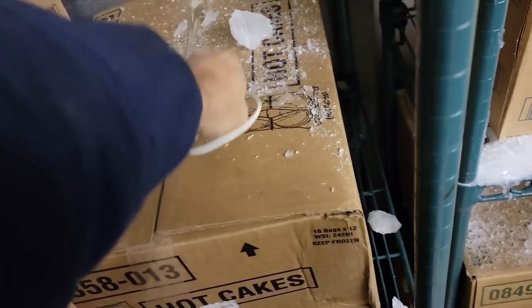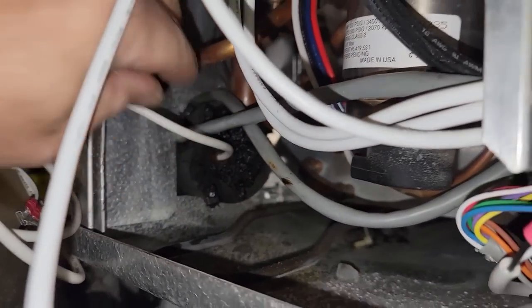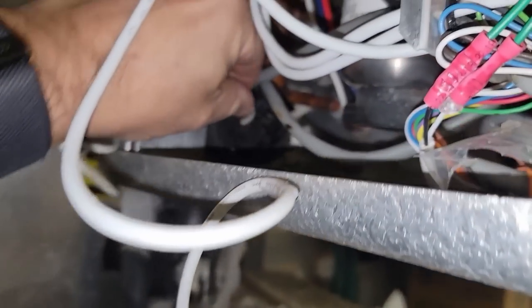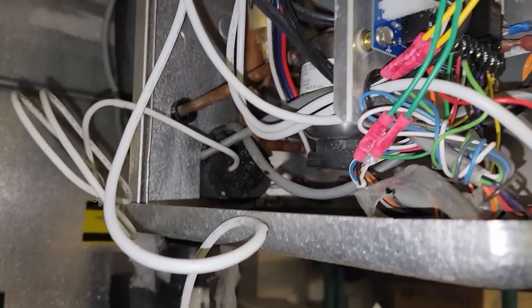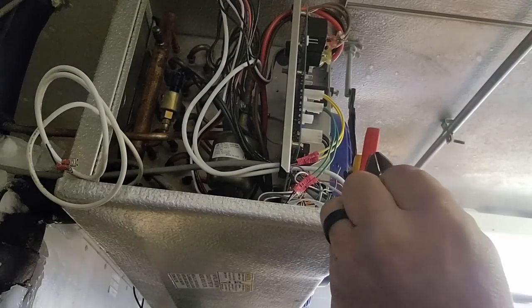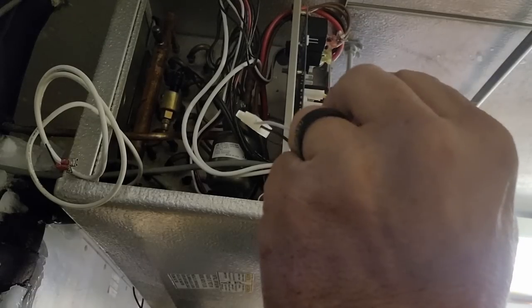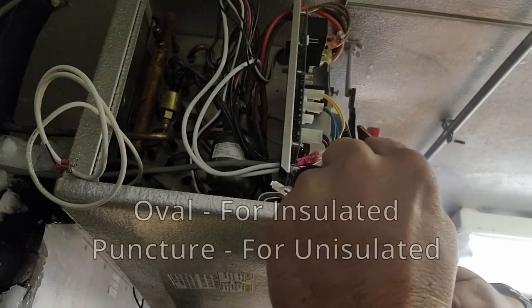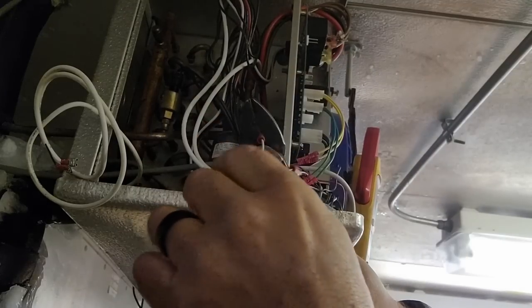Going ahead and getting the new sensor in while it's still fairly warm. It went right in the hole. We'll make sure we put a wire tie around it so it can't pop back out — that area will potentially condensate and ice could shove it out. With these Ovals they do a really good job; you're supposed to use the oval, not the puncture type. It shouldn't be able to pull out now.